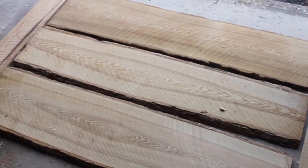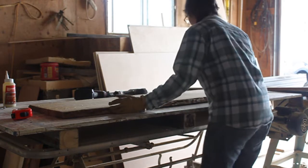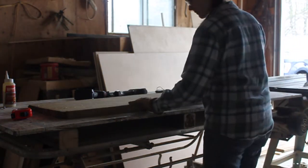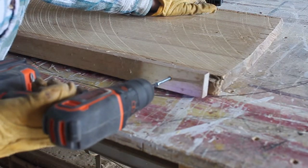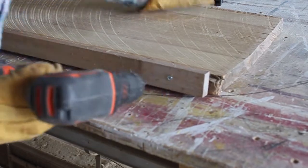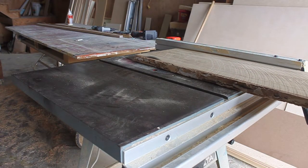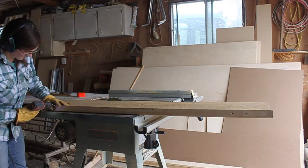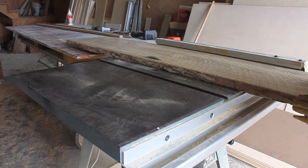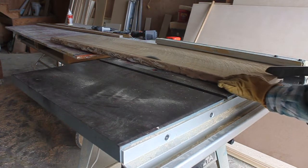The first thing I did was square up my boards. My boards were quite old, they had a live edge on them and were rough, so I needed to square them up. I took a strip of wood that was nice and straight and screwed it to the side of the live edge, then ran that through the table saw to clean up the other side. Then I took the screws out, removed the guide, flipped it over, and sawed off the other live edge — that gave me a roughly square board.